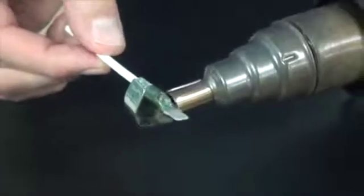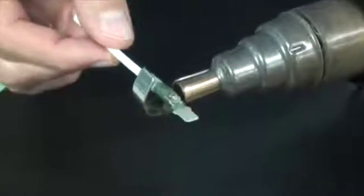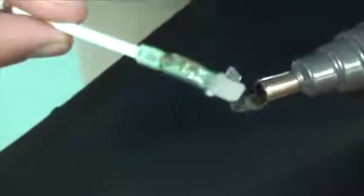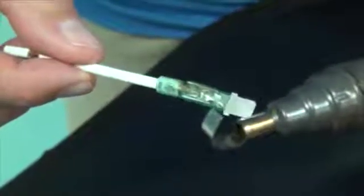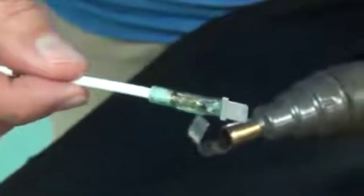Move the heat back to the middle of the connector where the solder sleeve is. If possible, rotate the connector to evenly distribute the heat. Wait for the solder sleeve to become liquid. You can now remove it from the heat and let it cool for a few minutes. It is okay if some of the solder escapes the top of the terminal — simply tap it away and reseal the neck of the tubing while the tubing is still warm.